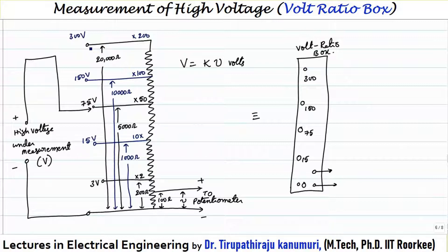There are some disadvantages of using the voltage ratio box. The high voltage supply is connected across it continuously. Previously, we discussed that an advantage of the potentiometer is that under balanced conditions it does not load the circuit whose voltage is being measured. However, here the ratio box is directly connected across the unknown voltage, so continuously current flows through the resistance — equal to the voltage divided by the resistance — causing continuous power loss in the resistors. This is a continuous loading on the input circuit, which is the major disadvantage.